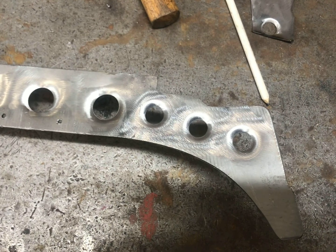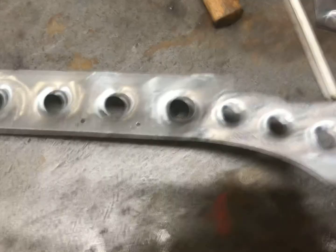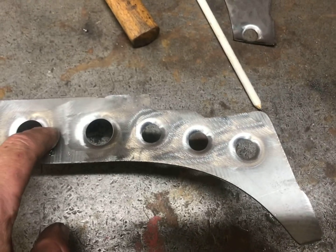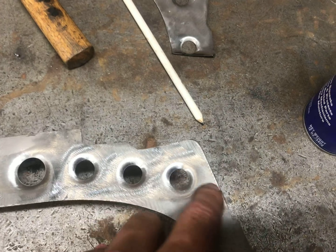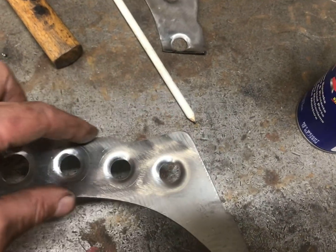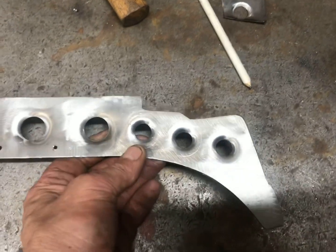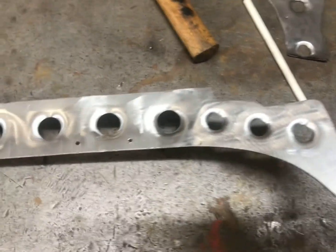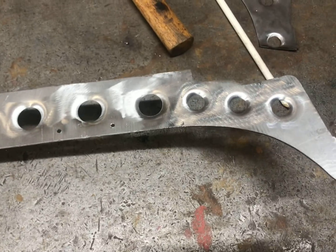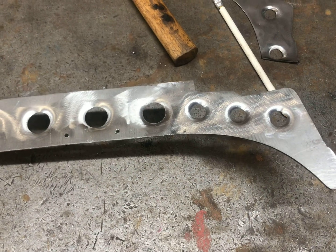And there it is with the 1/2 inch holes in there. Dimple die's done, and I think it flows well. From here on through, it seems to be kind of centered here. And that's kind of a weird transition to make. I think that's probably the best way I could come up with to do it. So we're gonna go with that. We're gonna put this back in the car again, and I got one more bracket on each side to make, should be pretty quick, and then we're gonna wrap up this part 2 of the structure.